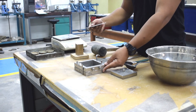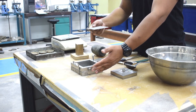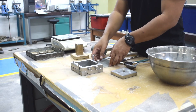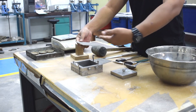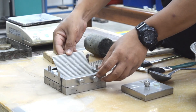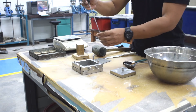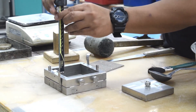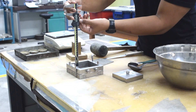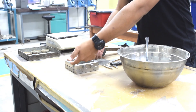How do you know the shear direction from this shear box during assembly? If you look into the shear box, there is what looks like a connection bolt at the side. This will be connected to the direct shear loading frame motor, where the pushing force to create shear will be applied. Next, we need to determine the sample height — it must be measured from the top of the base plate until the top part of the shear box.